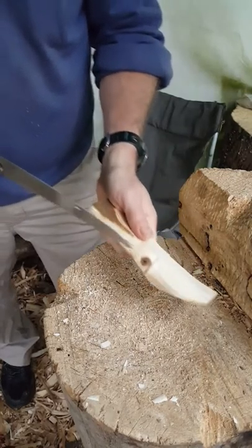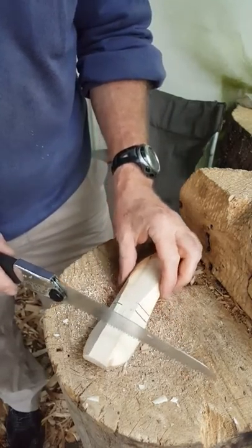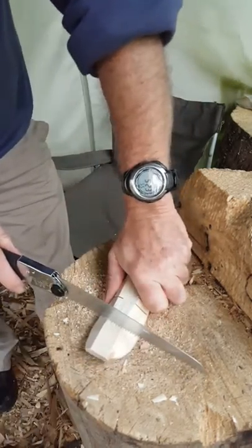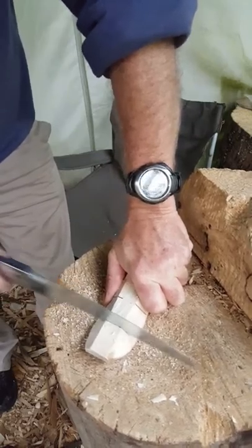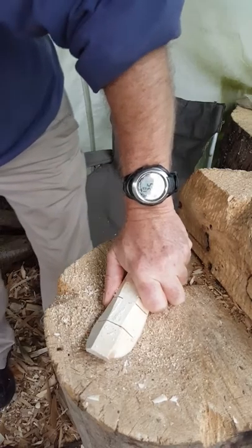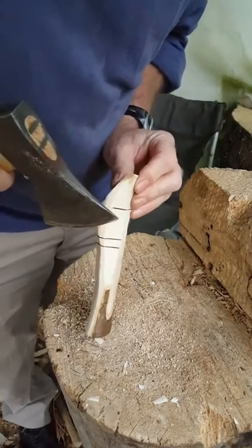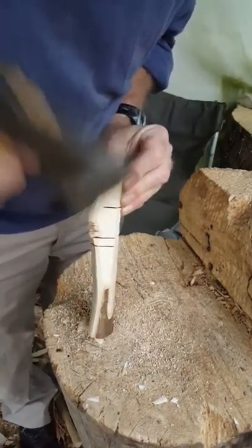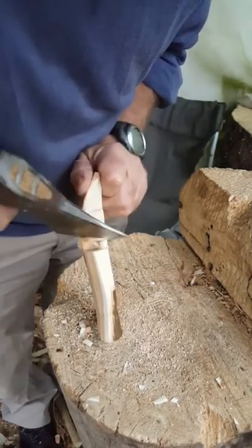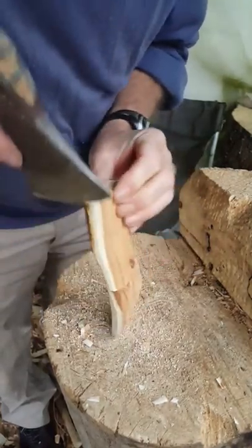Some people don't carve wood that has a big knot in it like that, so I'll probably ignore that side. I can also put a stop cut cross at the depth point of the bowl rather than cutting that with an axe. What these stop cuts do is allow you to then cut — for example, to the shoulder — down to that point, to the narrow point of your design. So like I did before, I generally start that with a bump which will cleave out to the edge.